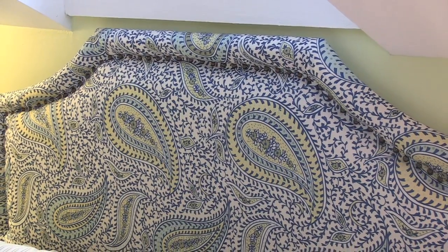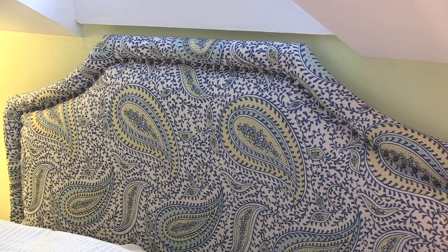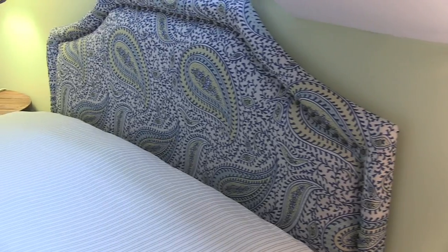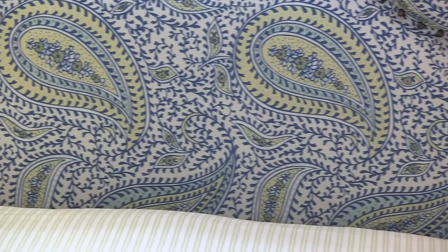Third, try to keep your nail heads relatively close together and an equal distance between one another. This is going to be difficult with an individual nail head trim, but try your best. It'll be worth it in the end. Once completed, the nail head trim will give you a depth on your headboard that you didn't have prior. That, combined with the textural difference, really makes this headboard a unique and custom piece.